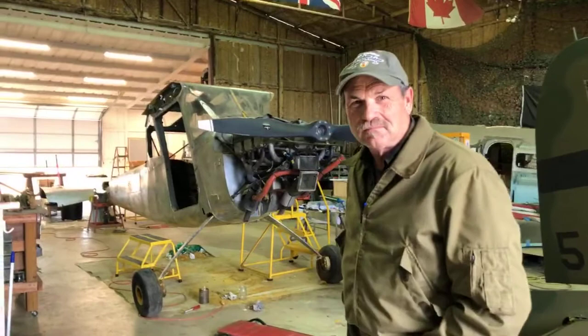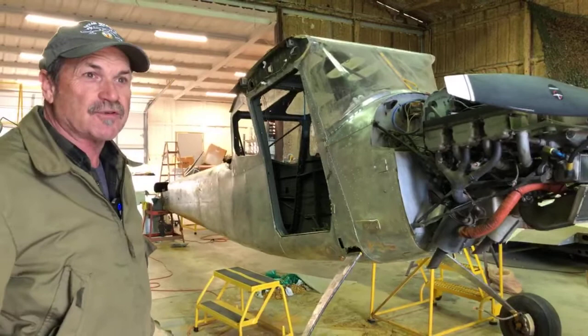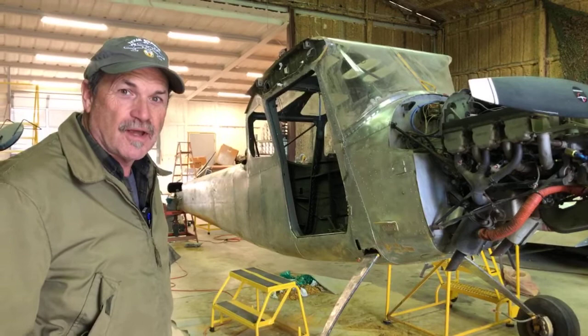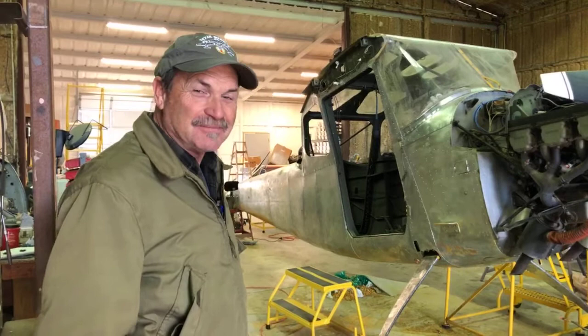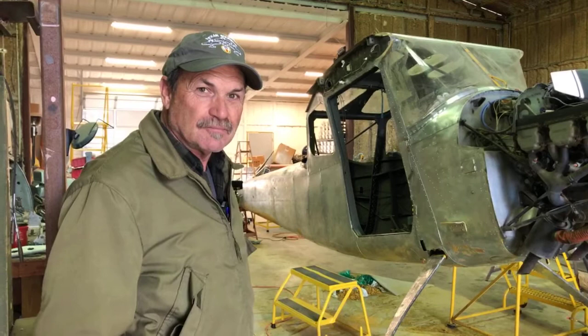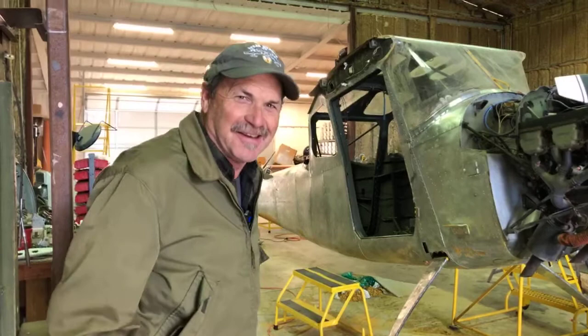As you can see, we've been chipping away at stripping paint. The paint stripping process is very temperature sensitive, and we've been lucky because we had a pretty warm November. All hands on deck when the temperature is over 70 degrees — we're stripping paint, because we can do other things when it gets cold but we can't strip paint. The airplane looks pretty bare right now. It's 90% done and 90% to go — the hard parts are on the bottom of the fuselage, which is laying-on-your-back work.